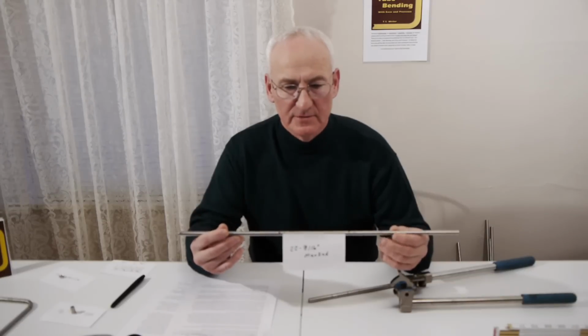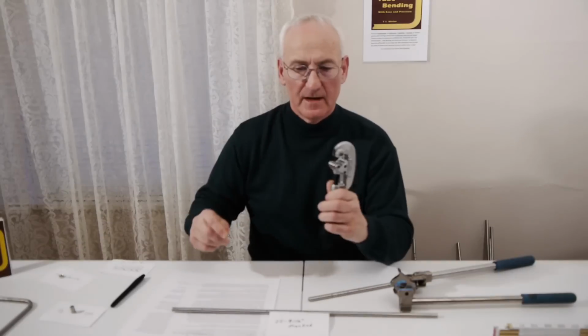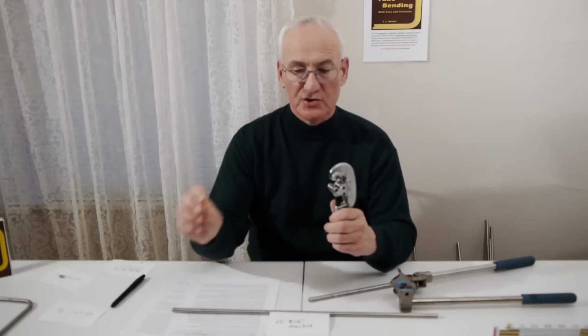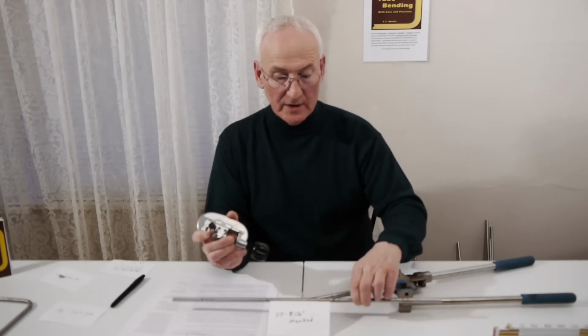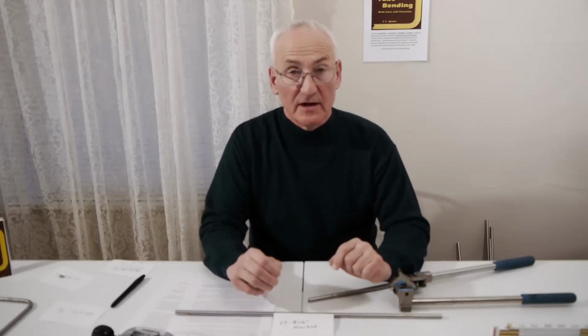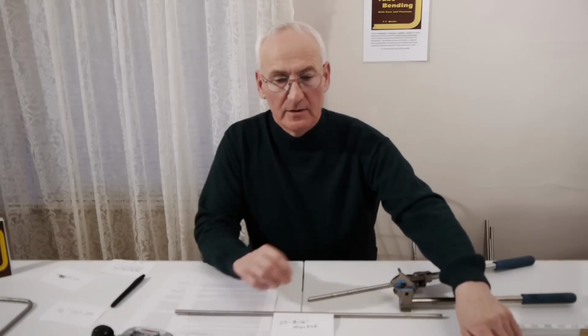6-inch square box. Use a tube cutter, such as this, and cut 1/2 inch off the end of the 23-inch end-to-end piece of tube to end up with a tube that is exactly 22 8/16 inches end-to-end. Sketch the layout that you will be bending. Your sketch does not need to be drawn to scale,